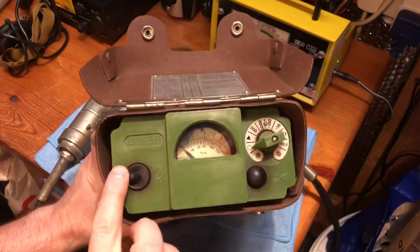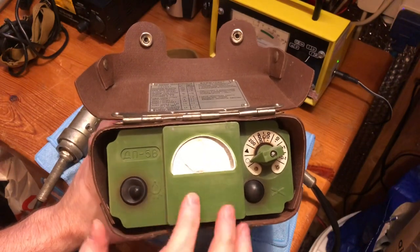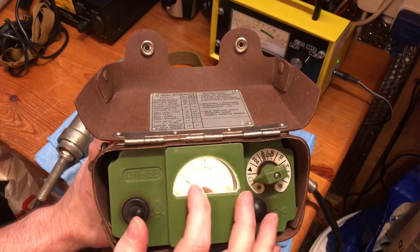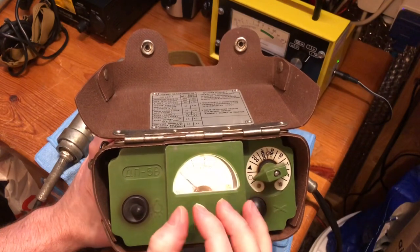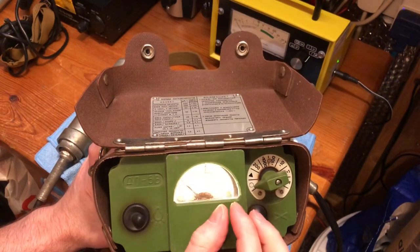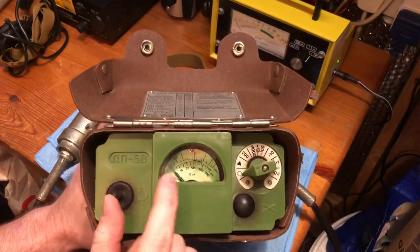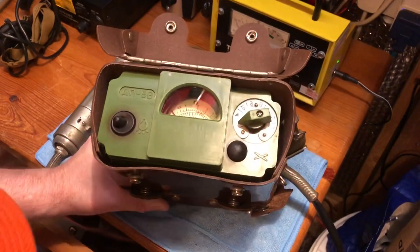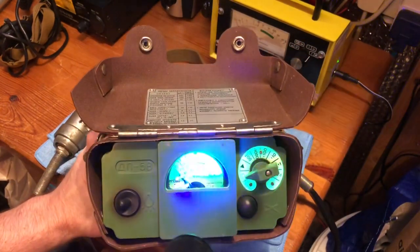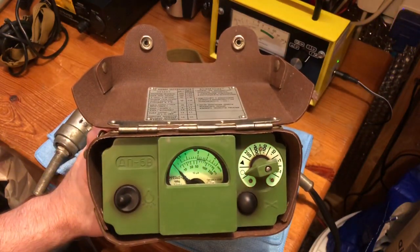The modification makes the backlight a lot brighter — they are proper incandescent miniature 1.5-volt bulbs and they light up much faster. The original 1-volt bulbs would slowly warm up, with one burning brightly and the other barely lighting, but now they come on almost instantaneously. You can also see the fluorescent display on the back — if I grab a UV torch you can see it lighting up. It's not a radium dial, just a normal fluorescent display, but it looks quite nice at night.